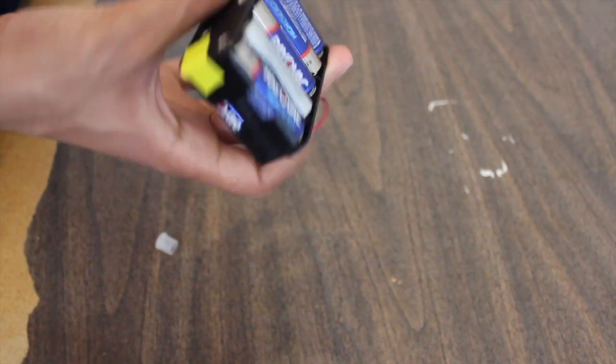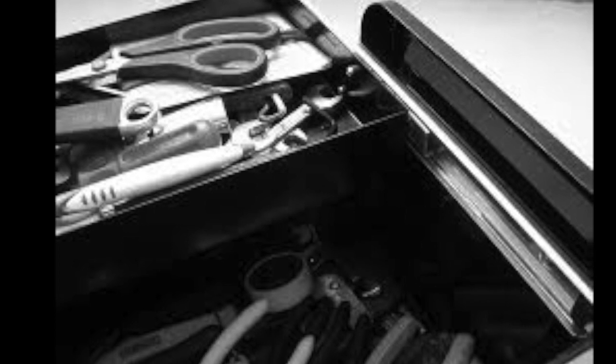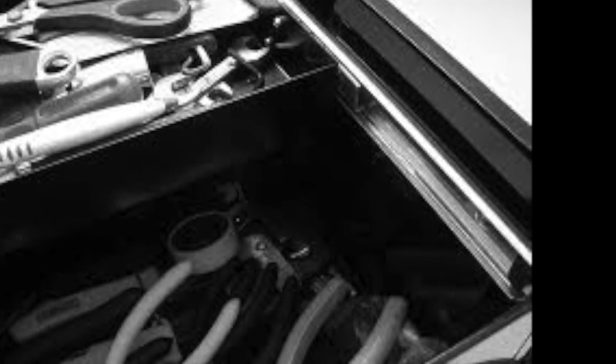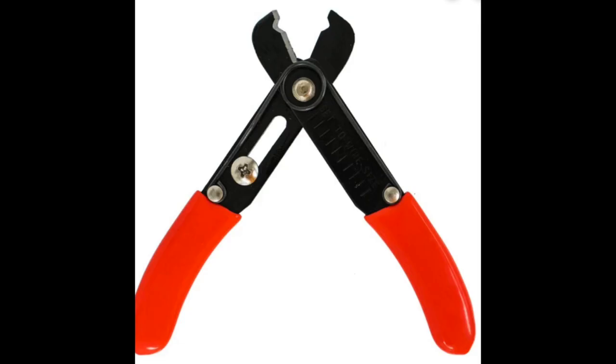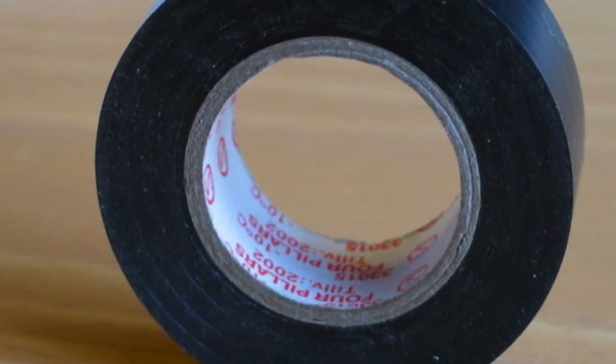You're also going to need a power source of about 10 to 15 volts. I recommend using a battery pack of 10 AA batteries. You can find a battery pack holder online as well — I'll put that link in the description too. A few other materials you might just have lying around at home are a wire stripper or pliers and electrical tape, which is optional but recommended.